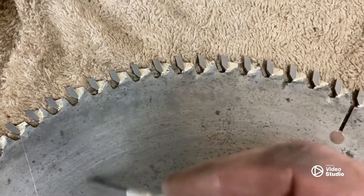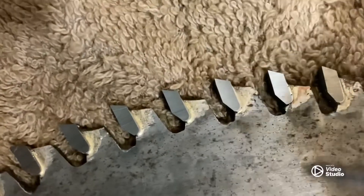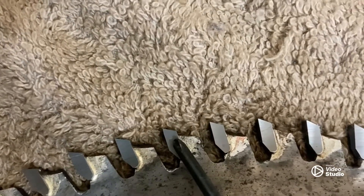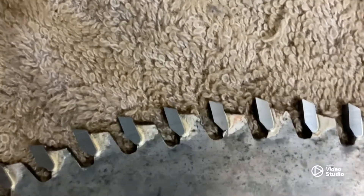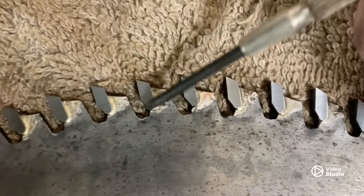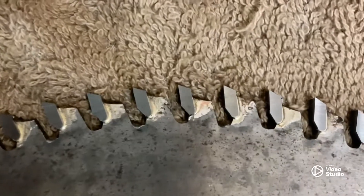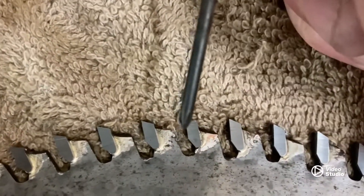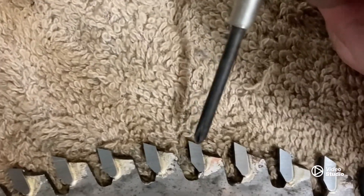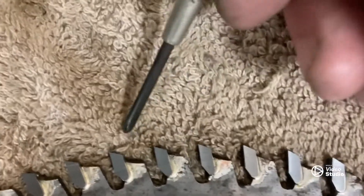All right guys, so we're out of the side grinder. What we're doing on that side grinder is putting radial and tangential clearances in. Radial clearance is the clearance between the front and the back, which is one and a half degrees. Tangential clearance is from the top to the bottom, which is two degrees. So we built all that in on that side grinder. At this point we've done face grinding, side grinding, and put in tangential and radial clearances. Now we're going to hit the top and put the top cutting clearances in, and we're done.